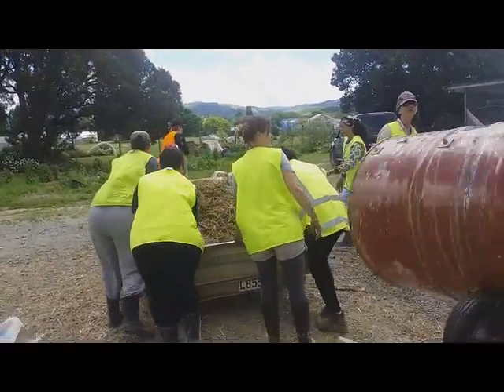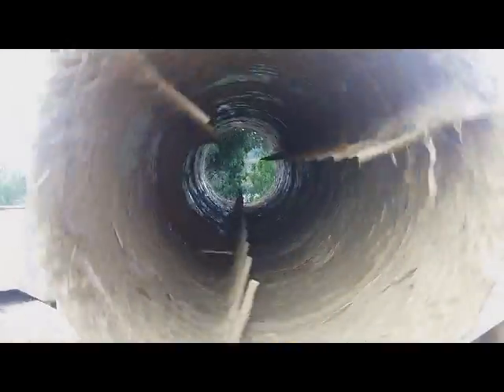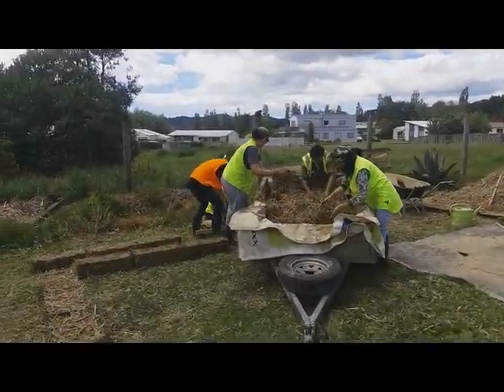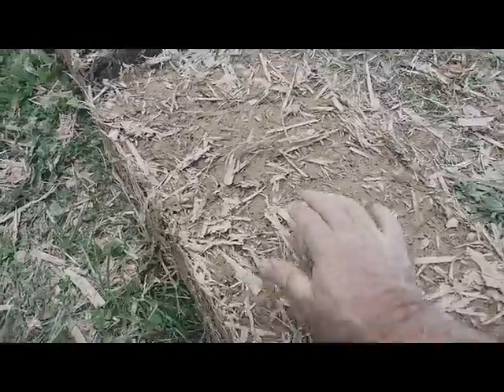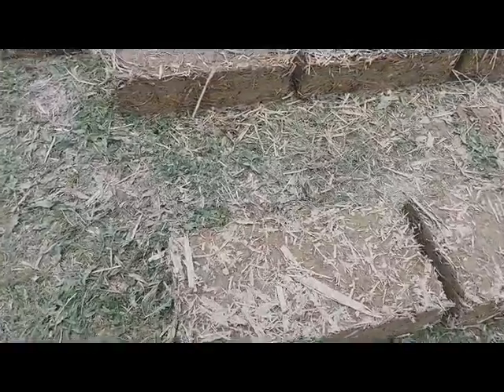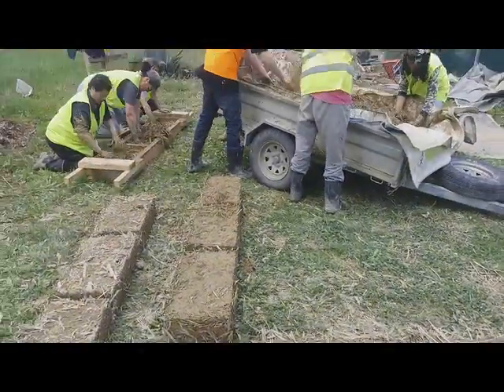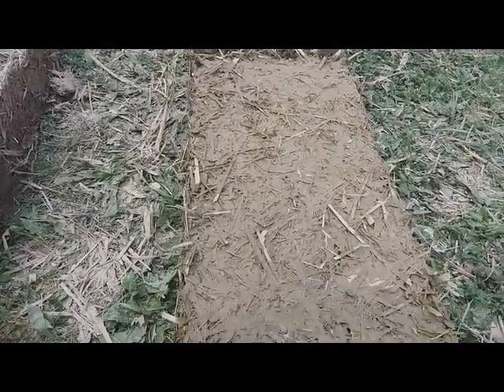We just flushed our timber out and you can see they're moving our next load over to the molds. Even blocks that we made earlier today are actually starting to dry on the surface and go a little bit solid. These blocks are going to be rested on the edge — even though this block was made this morning, I could actually flip it up onto its ledge so it will dry faster. Here we've put a more gluggy mix to bind the top surface stronger, and we add a little bit more clay.